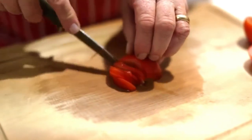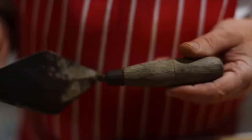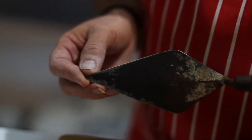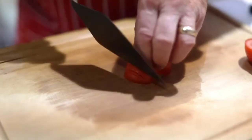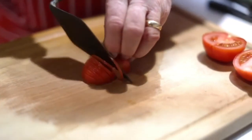The other type of carbon steel you get is drop forged carbon steel. This is incredibly hard. This is a pointing trowel made from drop forged carbon steel and the regular job is to crack through bricks and rake out cement joints. I put a cutting edge on this from scratch and it took me 10 minutes — just to show you that no matter how blunt your existing knife is, no matter what steel it's made from, if you can do this to a trowel in 10 minutes the bluntest kitchen knife you have will be razor sharp in just one or two minutes.